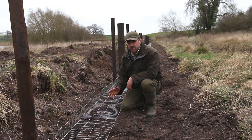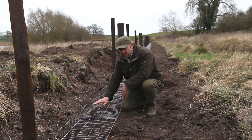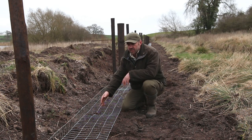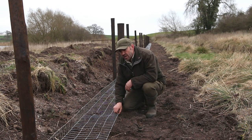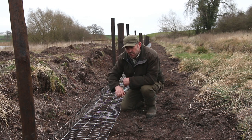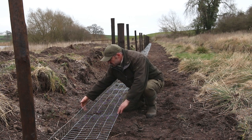Just a few little tips on putting out the ground skirt. The strainers go in first, then the posts, then the ground skirt. We're working anti-clockwise - we've rolled it out and bent up this hinge line at 90 degrees. If the land is nice and flat it should create a nice flat line along the hinge sticking up. You need to tack that with some 30mm tacks and a little hammer to the base of the post on the bottom wire. If you tack it at the top it tends to pull away and isn't as neat - tack it as low down as possible.